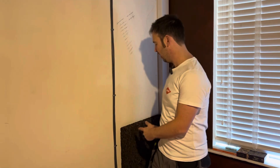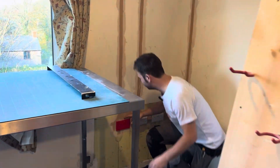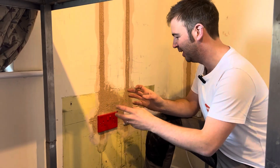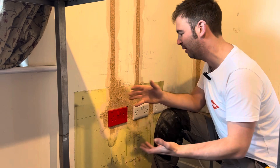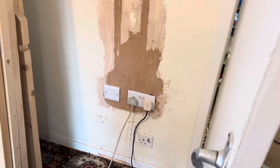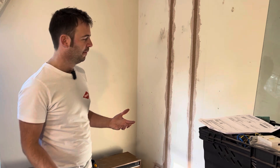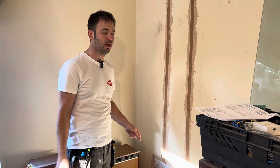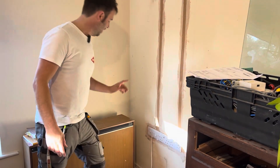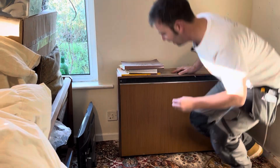This wall is being studded out, hence why the cables are surface. This is my main run of cables from the loft above, coming straight back into the garage — I've encapsulated them in trunking so it looks neater, even though the client is going to insulate and board this wall. There's the red socket so the client can mess about with lighting without tripping the whole house. I've also run some Cat6 cabling for future-proofing — the client doesn't have internet currently but plans to, and there'll be a router location, a couple of USB sockets, and an access point option.